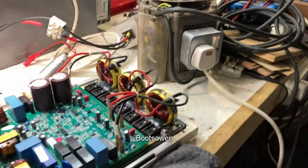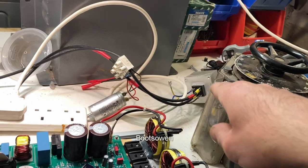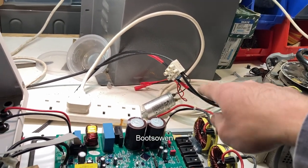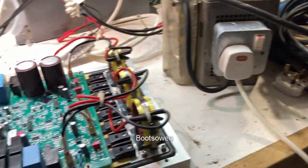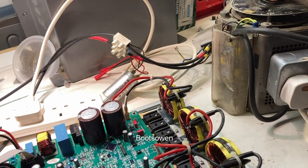Let's turn up the voltage a bit. So I've got it on a Variac into an isolation transformer into a DC rectifier, then through a capacitor and a bleed resistor into the DC inputs of this, and the AC is just plugged straight in there. Oh, it's sucking now — I can hear it. 487 watts. I'll turn it down a little bit — I don't want it getting too hot.